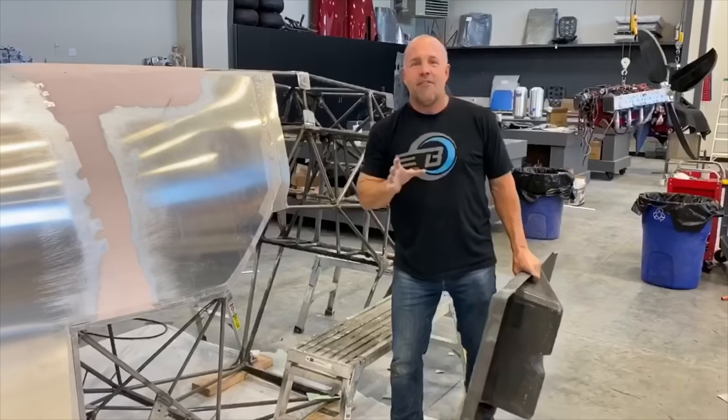Here's a bracket - tightened everything up so none of these can twist out of alignment. As I'm welding one spot it likes to try and rotate, so I'm going to go through real quick with the MIG and burn all four sides and all four points. Once that's all tacked all the way along, I can go through with the TIG and run out full length beads and clean it up. It's hard to see but even this end bracket has a three degree curve to it that matches the curve I've got on the plate on the wall - I drew that all on the computer. I've machined these on the machine so the fit is exact. All the spacers - you can see I just rotate this up, there's nothing to measure. It's either perfect or not. Ready to tack it in place with the MIG, we'll burn it with the TIG later.